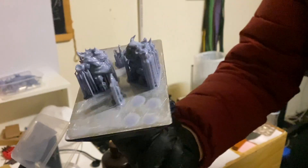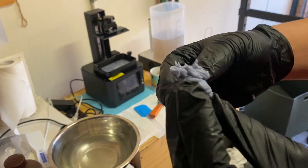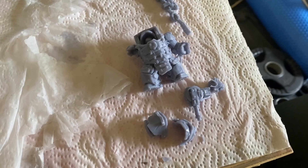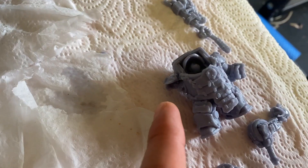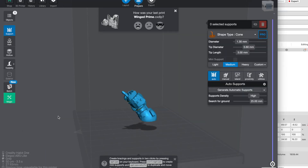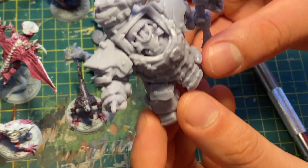I did this with some Puppets War demons, as I only had eight models and wanted a nice round ten for two five-man squads. Once that was done, I finished printing a proxy orc war boss from Puppets War. Unfortunately there was a fail near the end of the print on one of its arms — it's hard to tell if that was a resin fail from the cold or just a support issue. Luckily I was able to cut the STL, reprint just that arm, attach some green stuff, and cover it with a shoulder piece so it came out nicely.